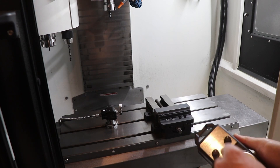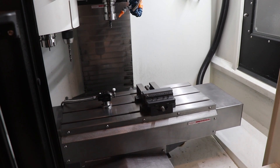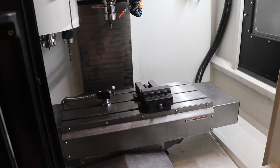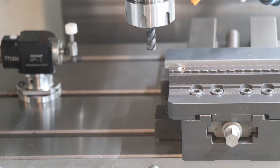Let's go ahead and jog over to the top of the part that I want to mill, and I'll show you with the screen what I'm going to do here. I've got this end mill to the side, moving in Z to the side and just above the top of this part. Now I'm going to switch over to my offset screen and move it to zero. The reason I have it to the side is — as I move this to zero in my work coordinate system — I don't want it to collide with the top if there's an error, like there was before.